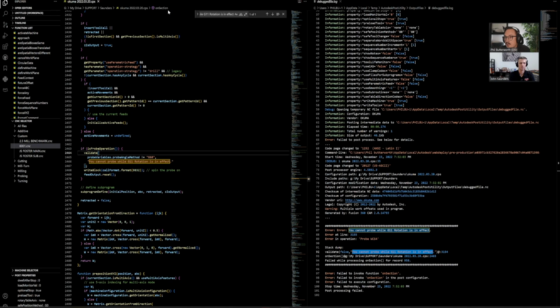If it's on open, that means as soon as the program's first started, it runs everything that's in the on open section and then never runs it again. If it's in the on section, it runs it every time there's a new toolpath. And that's the flow. So on section is almost like a CAM operation, like a 2D contour or face, right? Yeah, exactly.